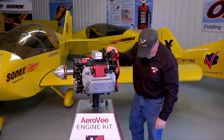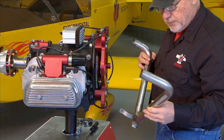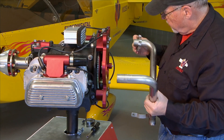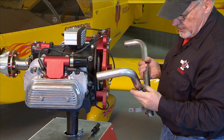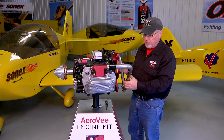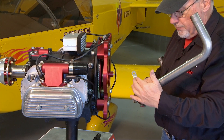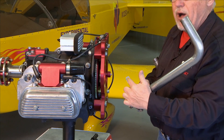With the sleeves installed, we're ready to temporarily install the intake manifold. The intake manifold for the normally aspirated AeroV is a Y-shaped weldment. These longer ends go into the collars on the intake elbows. Don't forget to put your hose clamps on there. This is a temporary installation because we will have to remove this intake manifold in order to build our cooling baffles, so we're just test fitting now. One of the reasons we want to test fit is because this bracket on the bottom that supports the bottom of the intake manifold will come to you in a straight condition without the hole drilled in it.